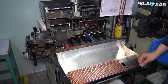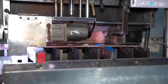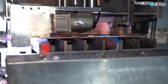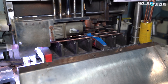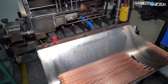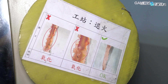After a full day of baking in the oven, the heat pipes are moved to get soldered on one of the ends. The soldering machine uses what amounts to an ammunition magazine, except it's filled with heat pipes. It hops the pipes through the process. The machine can solder one pipe roughly every two seconds, again with multiple machines in use, and uses a set of two platforms to exchange heat pipes down the line. The arms actuate and push pipes through the stack, with an arm moving back into the magazine to fetch the next pipe with each successive solder. Once soldered, the pipes roll into a receiving bucket, where they wait to be moved manually to the next step. At this point, there's a manual quality check to ensure the heat pipes look as they should, using reference materials to check the desired result.